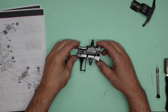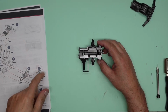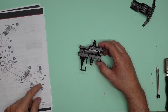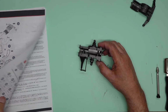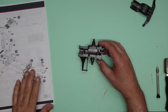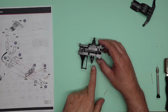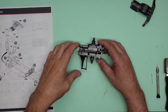Okay, and we're back. So I've emailed Pocher and informed them of this issue with this J screw and that. Told them what I've done, told them about the fix I've done, and suggested to them the minimum they need to do is add an M2, was it M2? Yes it was, wasn't it? An M2 by 5 PWM screw to give you a bit more thread, and I think that will cure the problem. Of course, if you don't tap the thread like I did, you may not have the problem anyway, but we'll never know that because I tapped the thread before I tried it.